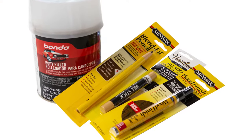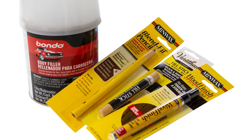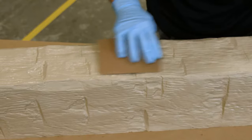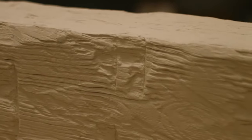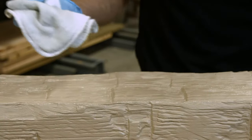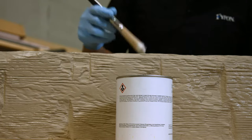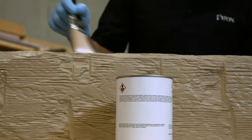For deep scratches, fill them in with a wood crayon. Body filler may also be used. Then lightly sand the area. You may have to manually etch grain detail into these fillers. Wipe off any excess filler with a cleaning rag and mineral spirits and allow it to dry. Then lightly paint the area with a matching primer and allow it to dry before staining.